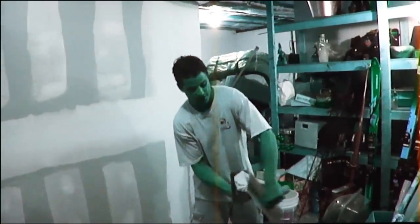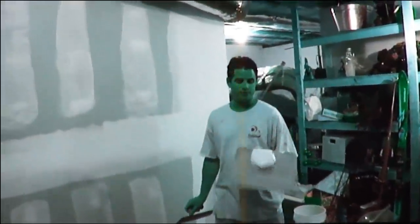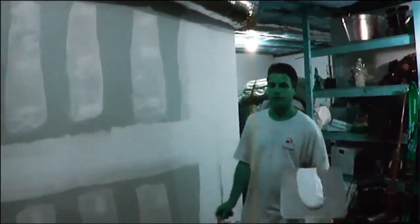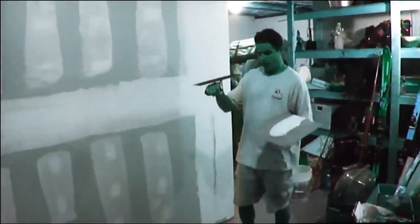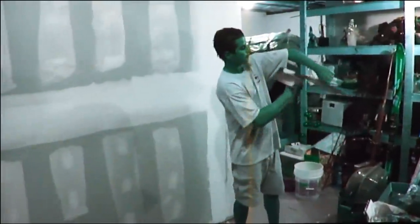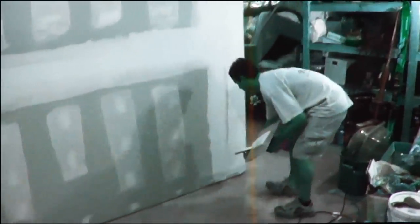So we're going to reorganize this here, put it like that, turn it counterclockwise, and then put it to a ball — we want it to extend the ball like that. To load up here, I'm going to turn my knuckles to the back of the trowel, go upside down, grab it like that, and now we're going to transfer this to the wall. So I'm just going to pull up like that, and that leaves it like that.